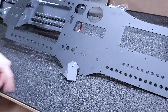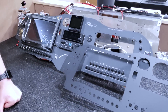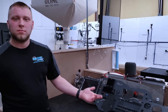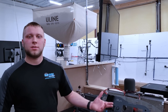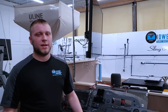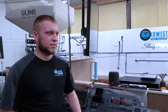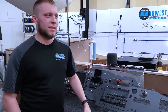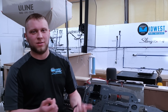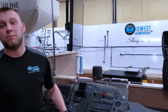We also have tanker gray, which is kind of like a Boeing gray — it seems like anybody who's a Boeing pilot wants to pick that color. In addition to the panel, we also powder-coat the throttle quadrant so we can match it to the panel. When you get a throttle quadrant from the factory, it comes with a 3M vinyl carbon fiber wrap. We prefer powder-coat because it's much more durable — one hot day in the sun and that vinyl will start to bubble. By powder-coating it, we deliver a much more quality product, and we laser-engrave all the labeling on it as well.